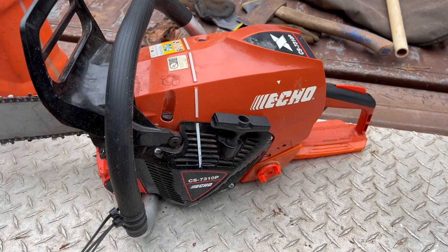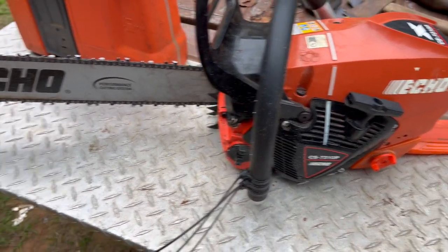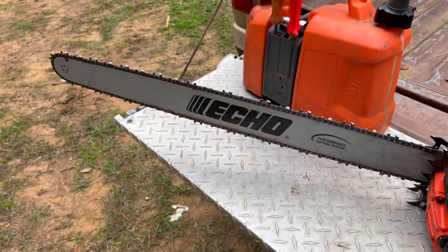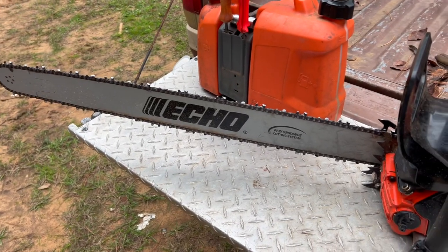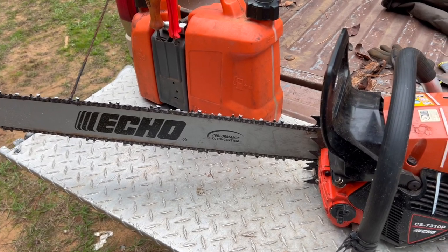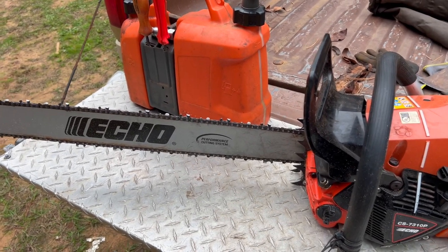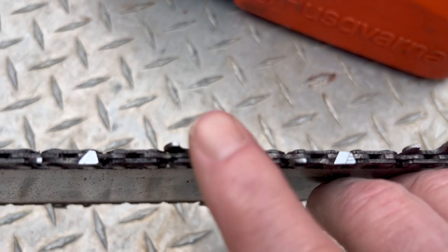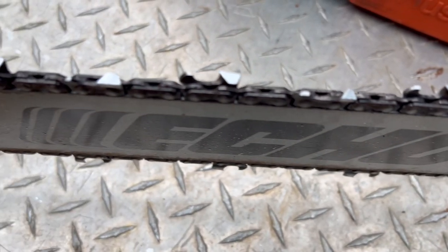Show you my saw. I have an Echo 7310. It's got a 32-inch bar on it. I do know that you flip your bar at least every time or every other time you sharpen it. So after I get done with this, I'm gonna have to flip it. That chain's pretty dull. So I'm gonna hit it